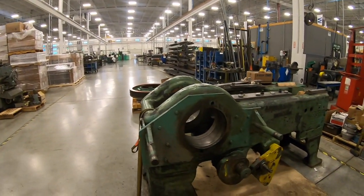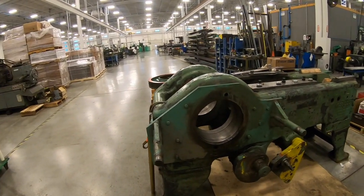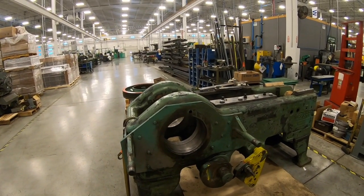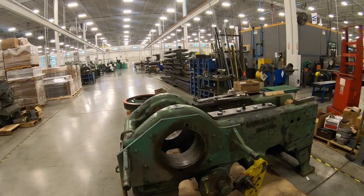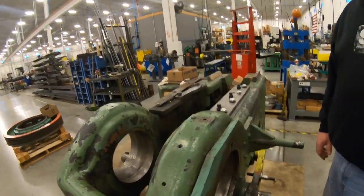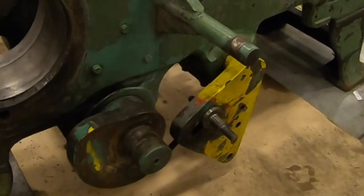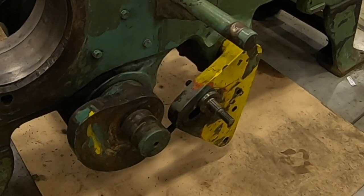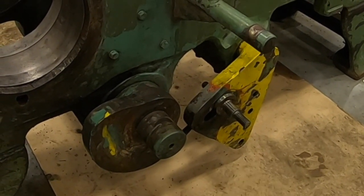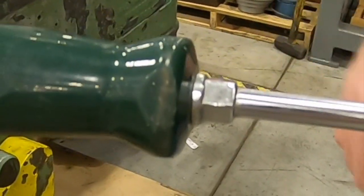Look at this real carefully, folks. This thing is 1930s era. We're not sure how much it weighs disassembled, but assembled it's going to be 17,000 to 18,000 pounds. The action is this crank spins right here — and then what happens with these two cams right here? The cams actuate, which actually lifts a two-position die in the ram. One hit would do the top die, and the second hit would come around and do the bottom die lift to make the hex on our screwdriver blades.